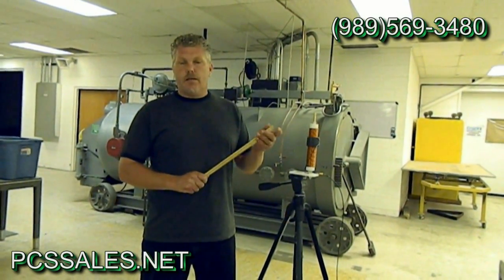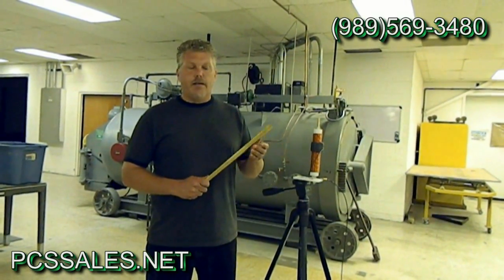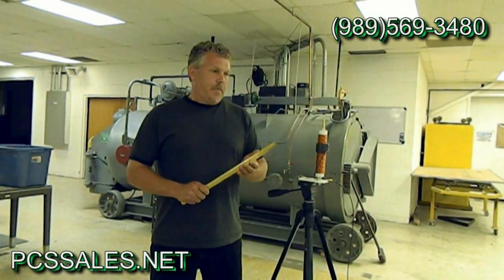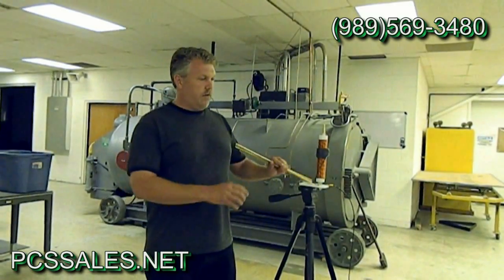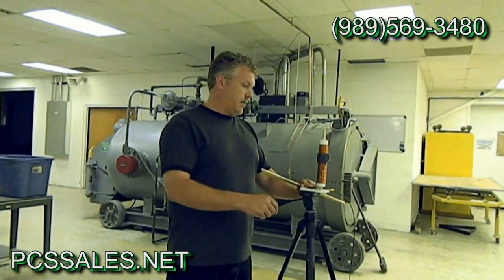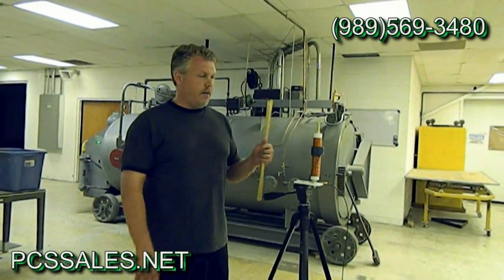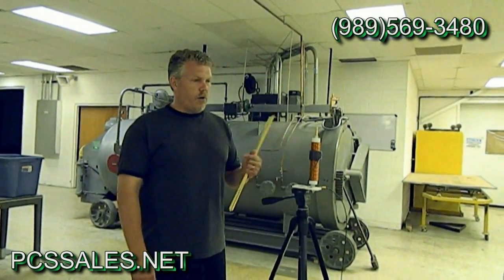A lot of the telescopic whips that come with the other models are pretty weak and easy to bend. The brass is a lot stronger. It comes in 18-inch sections, so very portable. Another nice thing about this antenna is it will tune from 80 meters to 10 meters continuous. There are no gaps — if you want to tune to 6 megahertz or 5.7 megahertz, no problem. Anywhere between 3.5 to 30 megahertz will be no problem with this antenna.